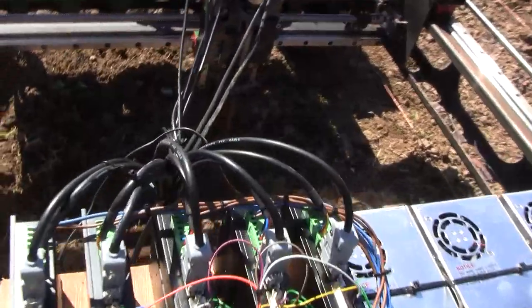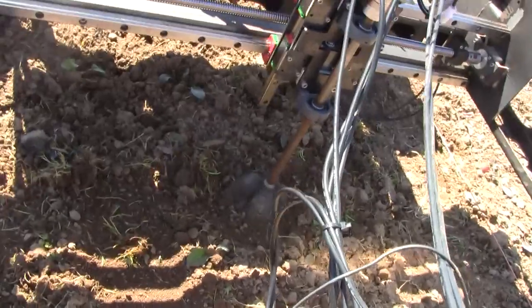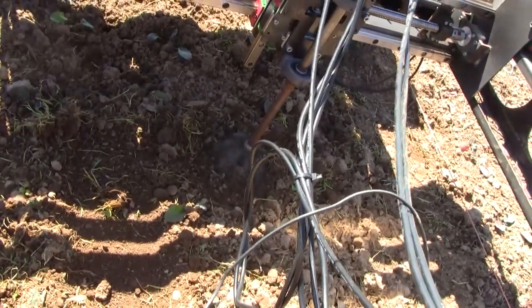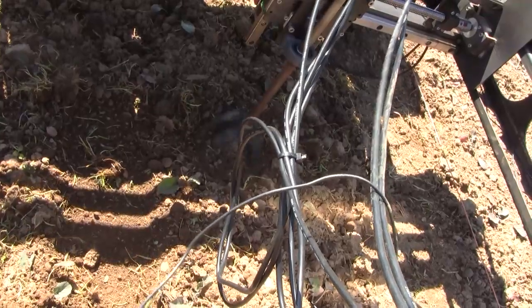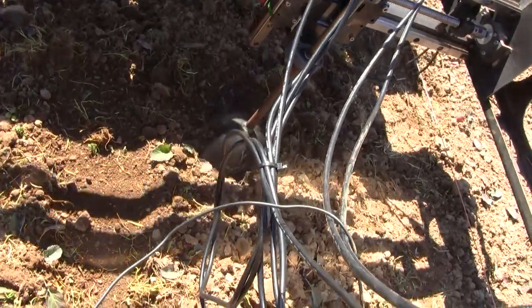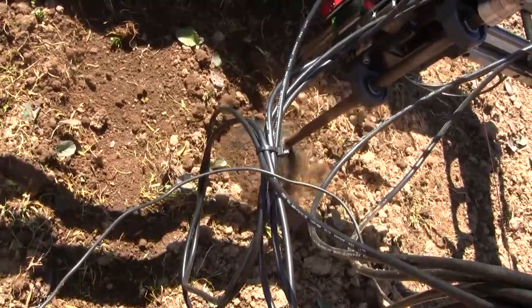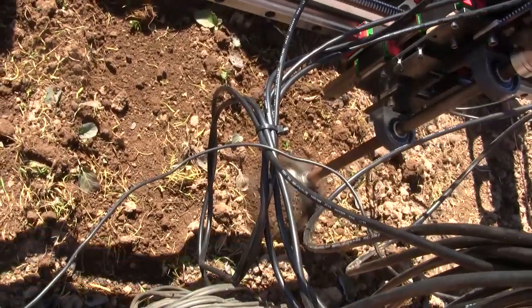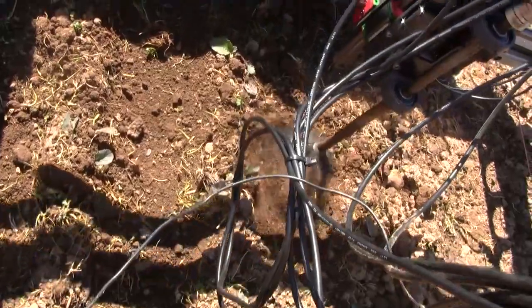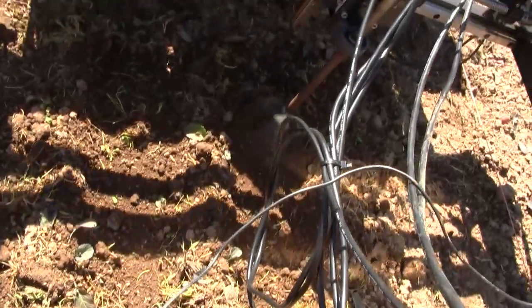Let's see if we can bring the mechanism forwards. I'm not going to move the machine — I'm just going to move these little saddles here on the X axis and see if the claw... there it goes, we are actually weeding. That's quite aggressive, and it looks like it's going to smash the leaves of those swede plants, but actually it doesn't — it's actually working really well. Even though it's touching the swede leaves, it's not destroying them, but any weeds in that ground are just going to be completely hammered.